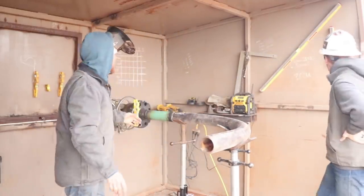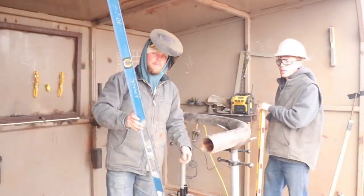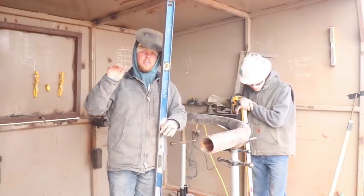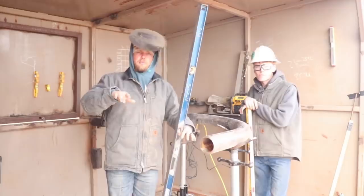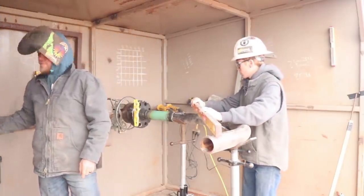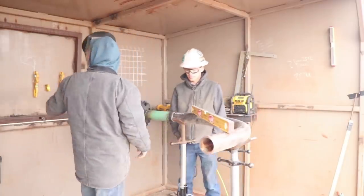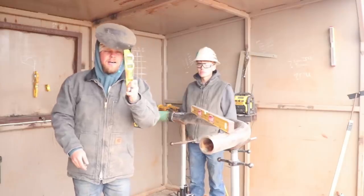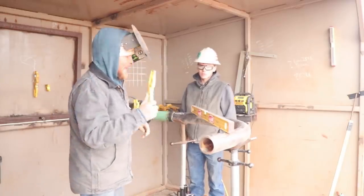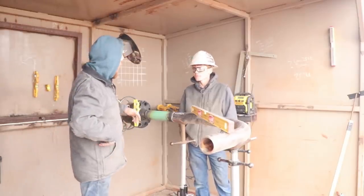Some of the things you're going to need — everybody wonders what my 6-foot level is used for. I love my 6-foot level; it's amazing, especially when you start getting on 24-inch pipe and things like that — it really helps you lay across fittings and get things leveled out. The 6-foot level I use to check square. I also have a 4-foot Stabila level — these things are made in Germany. I love them. The magnets are actually screwed into the level so you can drop it and it's not going to tear out the little round magnets. They've got big bubbles, they're solid.